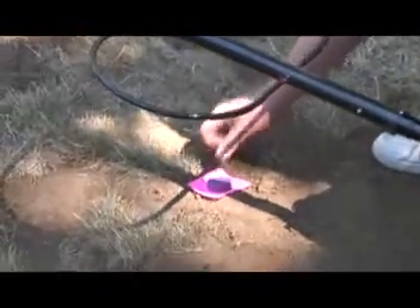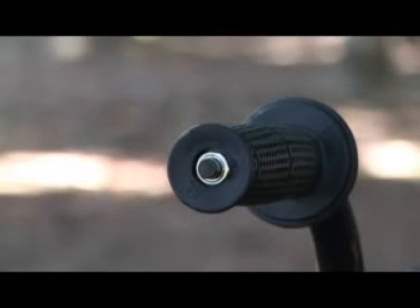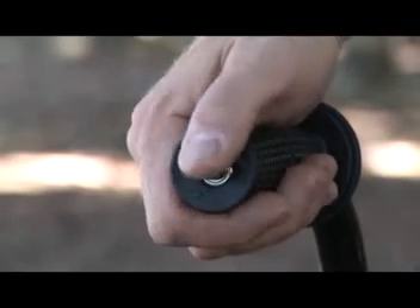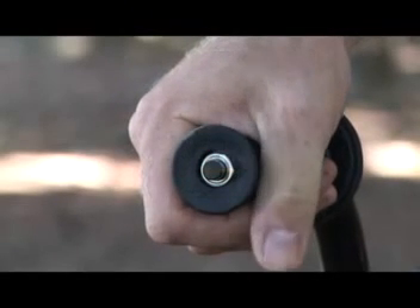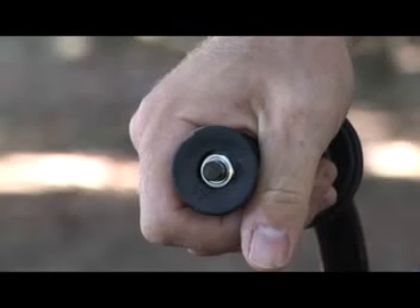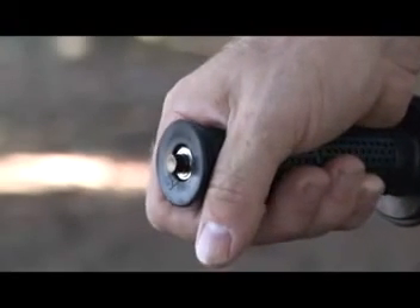This requires skill and experience. Most users should operate in auto until some field experience is gained. The push button is located at the tip of the carrying handle. It's used in the no auto position to reset the threshold hum when it drifts up or down. It does the job manually that the auto position does automatically. Also used during pinpointing — when the push button is pressed and released with the detector over a target, the signal will be reduced in intensity and magnitude, aiding in locating the target's center.